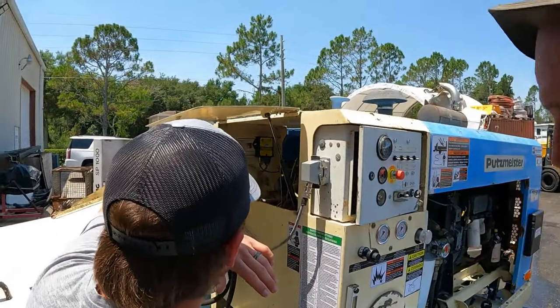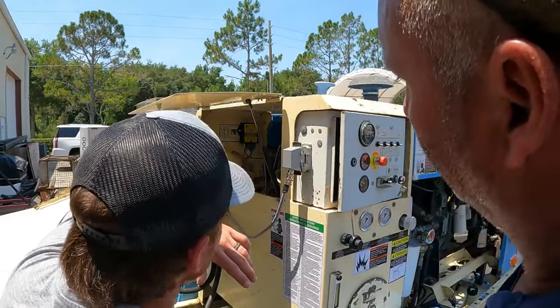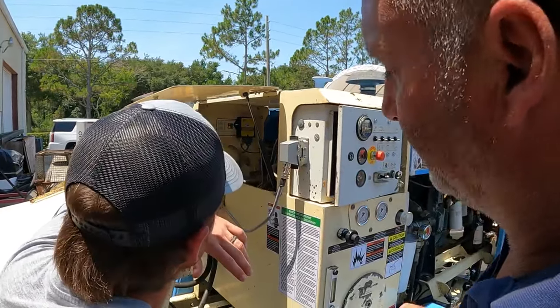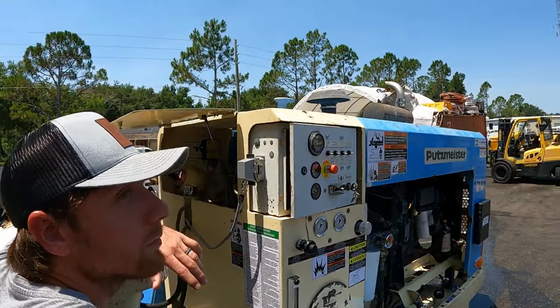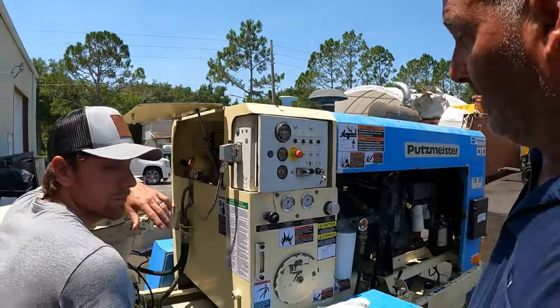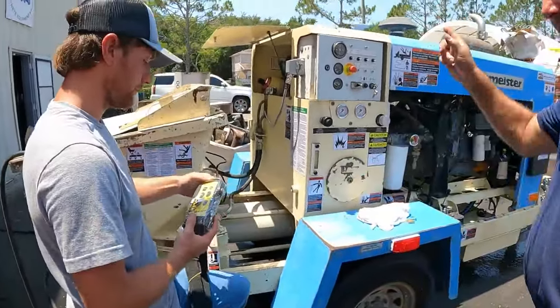You see the blinking? Yeah. If I use a function, reverse, you get the third light. You got a fire. I turn it off. It goes away. Well, it still ain't working. Well, I know it's in the transmitter, not the receiver now. So we split the system in half. Now, if that second light is solid,